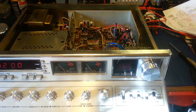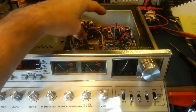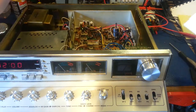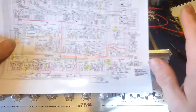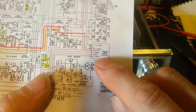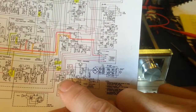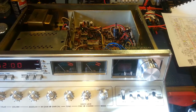It's a remnant of the odd power supply circuit they use in these radios. It's because they switched the ground in this radio, and when you turn the power switch off, the radio is not 100% off — it still has roughly two volts floating around on it, but very low current. It's an artifact of this frequency counter module. If you look here you can see there are two grounds: ground and CV radio — that is also ground. If you follow that trace down, that's what is actually switched by the power switch: the ground comes into the power switch and attaches to the main ground right here.